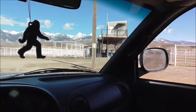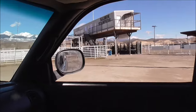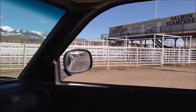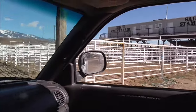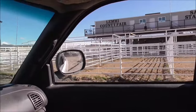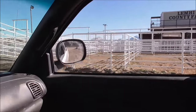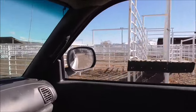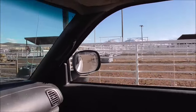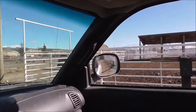But that little 4-H corral, it's brand new. We just put that in this winter. And it needs paint. But I've been kind of putting it off because of the weather. The painting surface has to be about 50 degrees. And right now it's about 50 degrees, the air temperature. So I'm really hopeful that I can even do this.